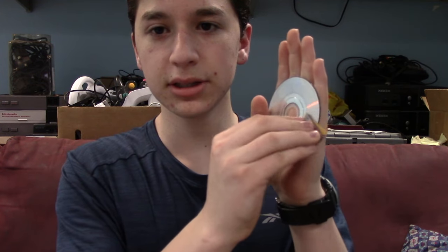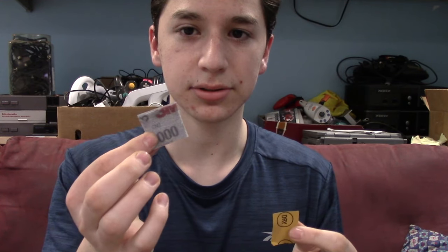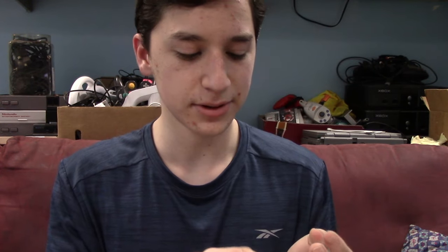So what you're going to want to do is do this for about 5 minutes. And then when you're done with that, take the 3,000 grit and do the same thing all over again. Then, like I said, if you want, you can do 5,000 grit — it's not really necessary in my opinion, but it just makes the disc a little bit shinier when you're done. Sometimes there are a few scratch marks left over with 3,000 grit, and 5,000 will just get rid of those.